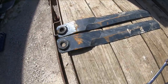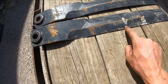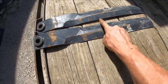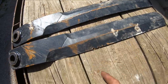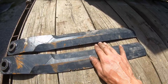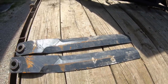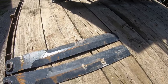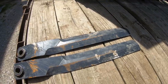I've got the blades gathered up here getting ready to put them back on. I don't think I caused these gouges — the paint's not off there and they were already like that when I bought it brand new; they're on the other side too. Something probably caught them during manufacture. Also, this one blade is pretty straight but this other one has a gap underneath — the whole blade is kind of bent, and that was like that before I even ran this thing. The research indicated I'd be buying blades anyway, so I said we'll let it go — but I'm going to throw this thing in the press real quick and see if I can at least take that bend out of it, then hit them with the grinder and sharpen them up.